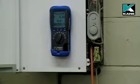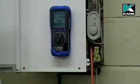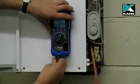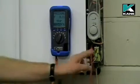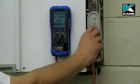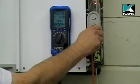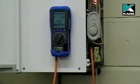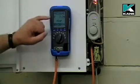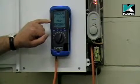What we're going to do is actually set a burner pressure as per the manufacturer's instructions. So we've zeroed the pressure sensor. I can now connect the hose to P1 — it's already connected to the boiler. Now I can fire the boiler. Just wait for the pressure to stabilize. Here we've got a pressure of 7.3 millibars.